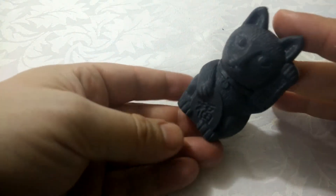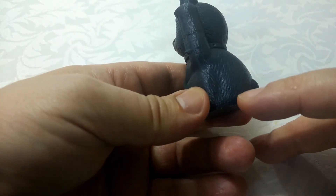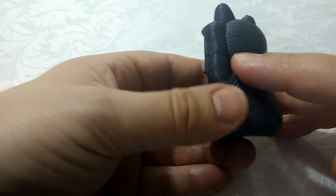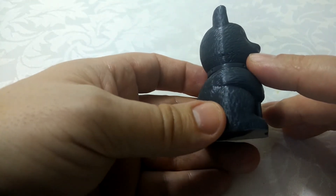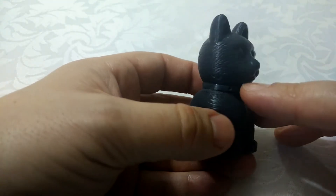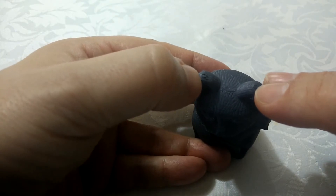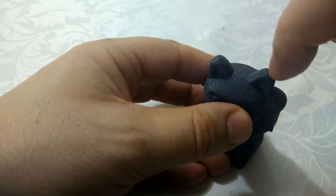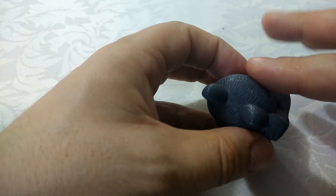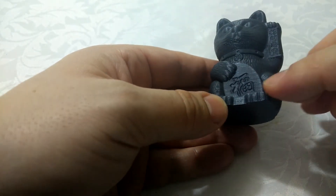The following day — I managed to get my cat off, it came off really easily. There is a little bit of layering visible down here. The big problem is just above the collar, which is definitely related to the filament binding up and trying to rip itself off the filament holder — I had to manually untwist it while it was printing, which obviously caused issues further up. I've also noticed on a lot of my prints these horrible little bits where the hot end seems to be digging in and burning slightly — that's something to look at, possibly controlled by retraction settings. There's a little bit of stringing on the back, but it rubs off.